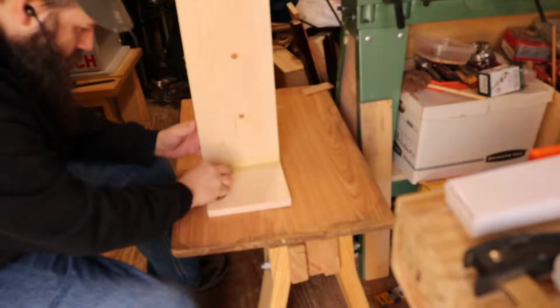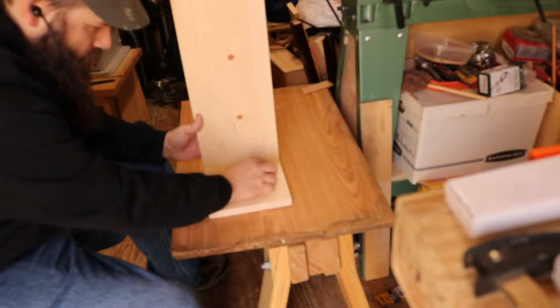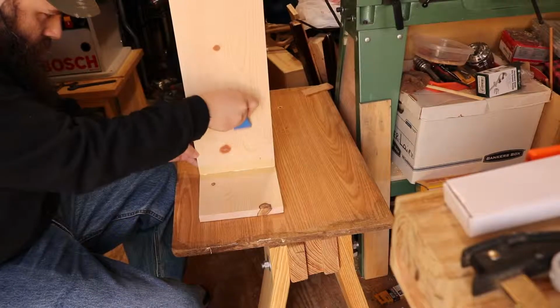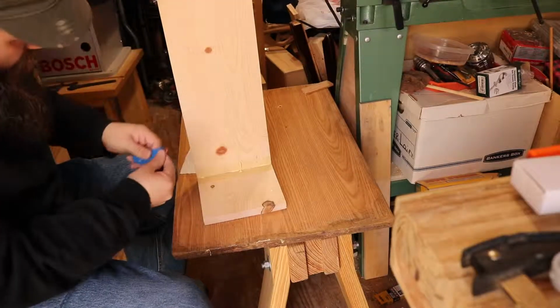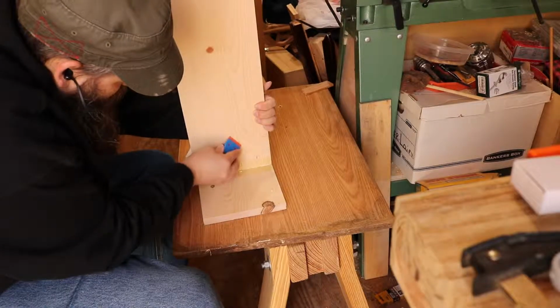After the recommended 30 minutes of clamp time, I removed the clamps and peeled off the masking tape. I used a scraper that uses these plastic straight razor blades to clean off some drips and get all the squeeze out from the corners. Even though the blades are plastic, they're still sharp enough to scratch soft pine, it turns out, but it's easier to avoid damage with these than with a metal tool.